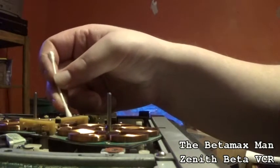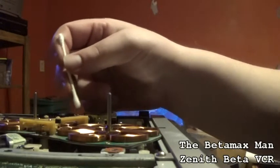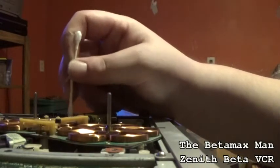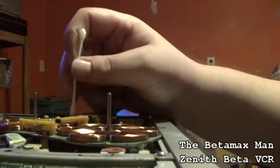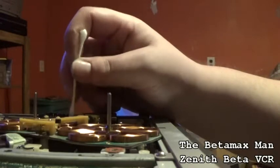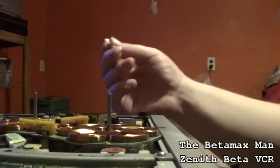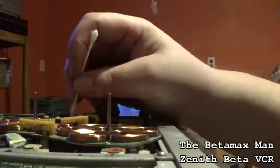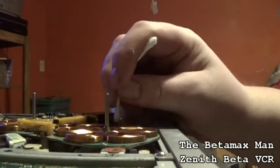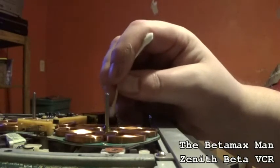And you know, this direct drive motor system did cause some issues. Sometimes you would get tape slack, and then the spool would speed up to try to catch up with the tape, and then it would put it into a... It wasn't a very well thought out design. It was also an expensive design, and Sony kind of got away from this design.